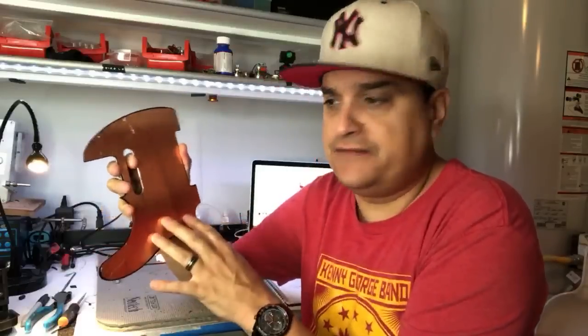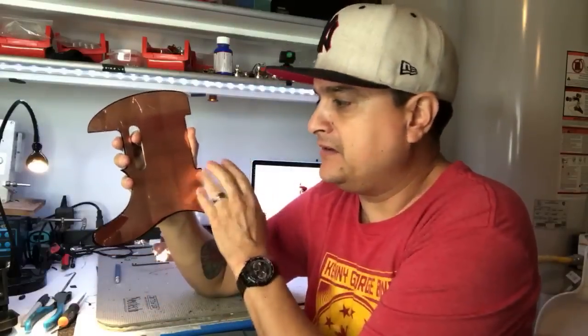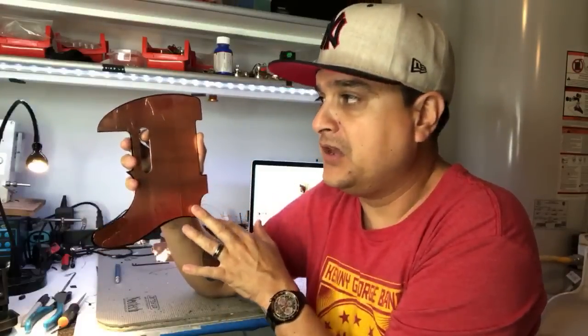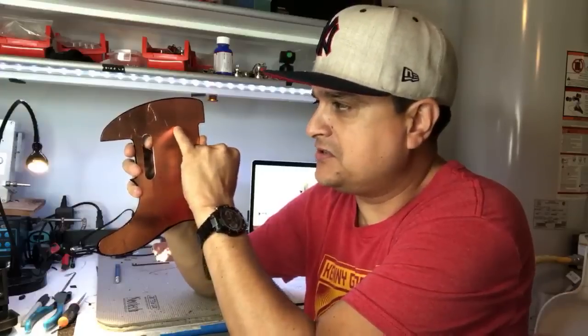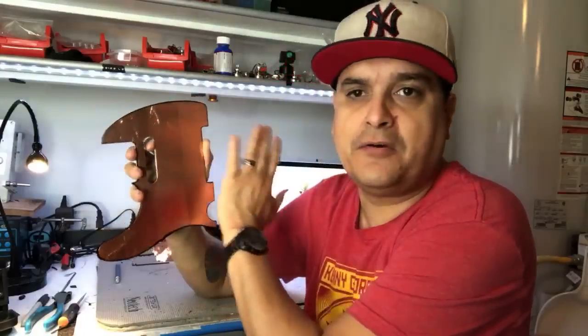But what you want to be sure of is to make sure that the glue that's on it is conductive, because this whole thing needs to be grounded to be effective. If just this half is grounded, then just this half is effective. The whole thing needs to be grounded to be effective. So a lot of times I'll take just one little drop of solder on each of these seams just to make sure that the whole thing is grounded all the way across, okay?